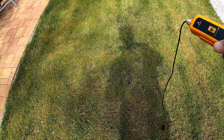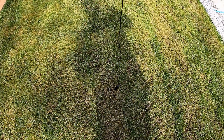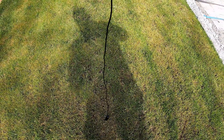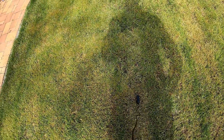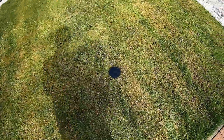Here at the sidewalk, I can already hear that the signal is getting weaker and becoming quieter. Here the signal disappears. When I move the probe across here, I hear nothing. But here there is another signal again. That means somewhere right here, the cable damage must be exactly at this location. I will mark the spot and then carefully remove the turf and look for my cable.